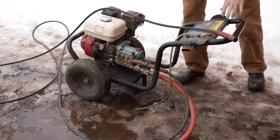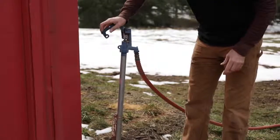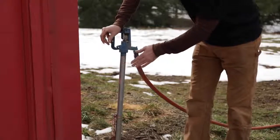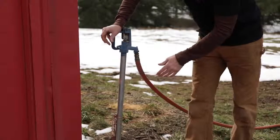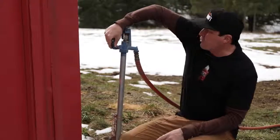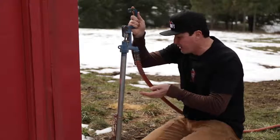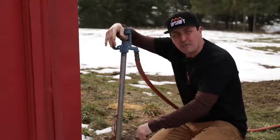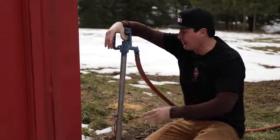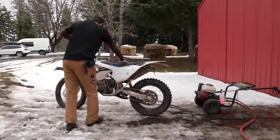Hooking up the hose — I often get questions about these strange spigots, mostly from subscribers in Africa. These are for cold weather. If you live in a cold climate, your spigots and standpipes will all freeze, so the valve is way down below the freeze layer. When you open it, it charges the standpipe so you can use water, and when you close it, it closes off way down below and a weep hole drains the water out. That's what those are for in rural or alpine areas.